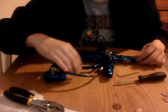So the first step in doing this — I'm going to tilt the camera down — there's a spinning fitting right here. What you're going to do is take your flathead screwdriver; there's a slot right here. While holding this, stick the screwdriver in the slot and you're going to unscrew it. Now that it's unscrewed, this is free to move. Make sure you don't lose any parts to this or else it will leak.